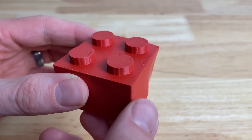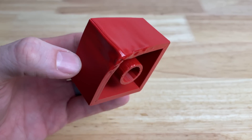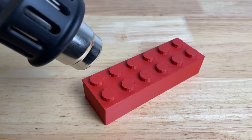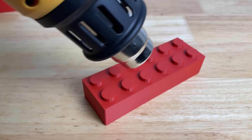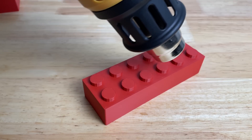Next is using a heat gun. This works especially well for getting rid of stringing, but beware of warpage — too much heat can make PLA and PETG curl like no other. Move around the geometry evenly without staying in one place for too long. Adjust the heat gun temperature and fan speed starting on the lowest settings and gradually working your way up.